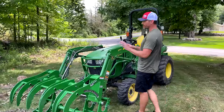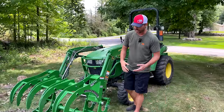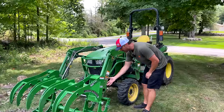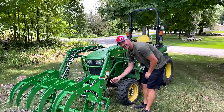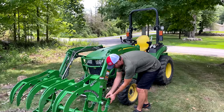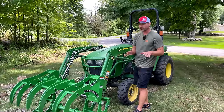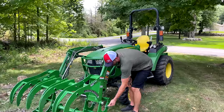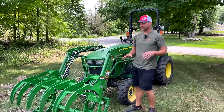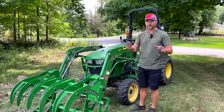But anyway, the brush crusher, they're gonna have it for John Deere Quick Attach. They have another version for Skid Steer Quick Attach. Now the Skid Steer Quick Attach, I always like to point out, a lot of the loaders are gonna have brackets for your stands on Skid Steer Quick Attach equipment. And so sometimes these brackets here, these stops, well, it takes more fine tuning. So you adjust this bracket up and down to find that sweet spot where it's not gonna interfere with those loader parking stands on there. Just pointing that out so you know that you gotta make some more adjustments there.